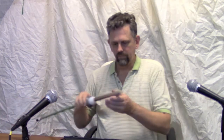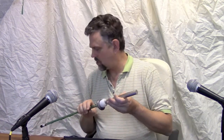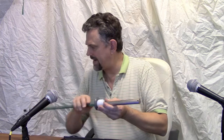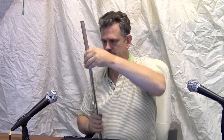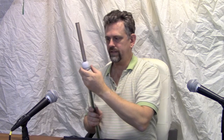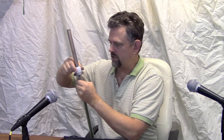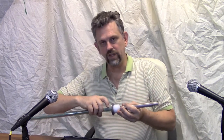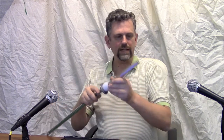Now let's take the cleaner version, SM3B. That one has one additional thing to think about, and that is the cleaner shuttle. You have to make sure you have a line here in good condition and that this is the right tightness. I'll put on a holder tube to check that it slides easily. If it sticks, you can loosen a little bit on the nut and it will slide a little bit easier. Then we want it on the right level. The right level is just above the turbidity sensor here.